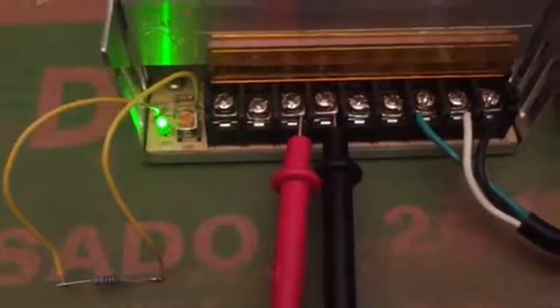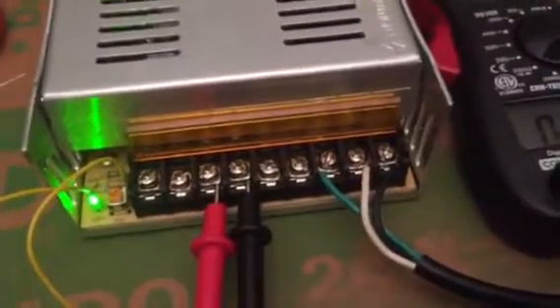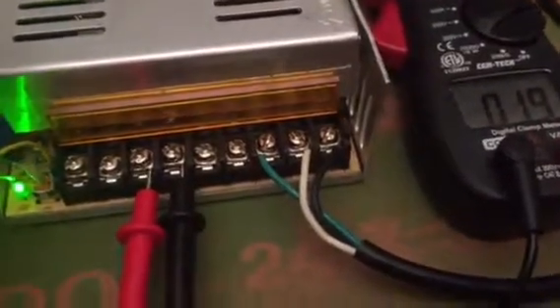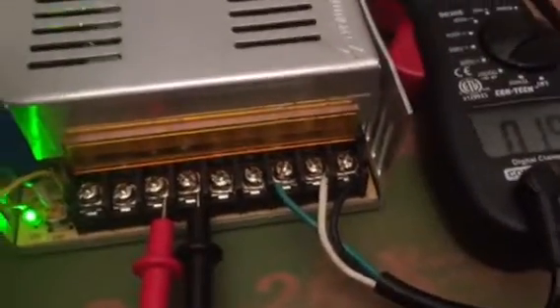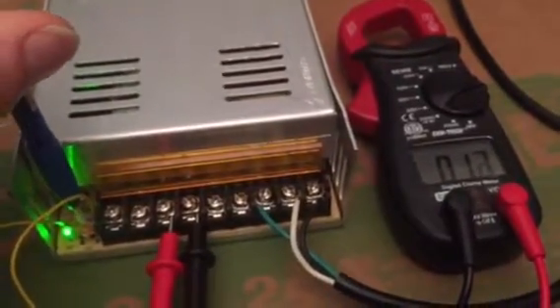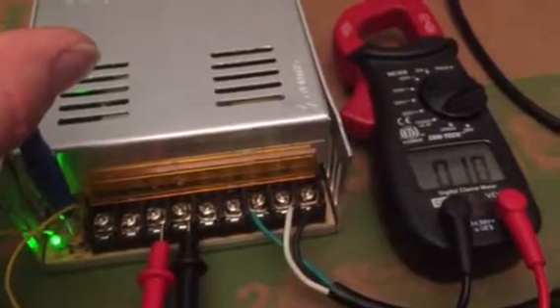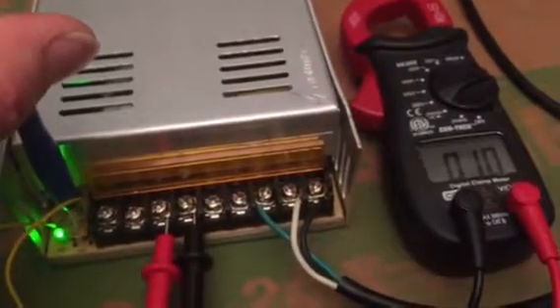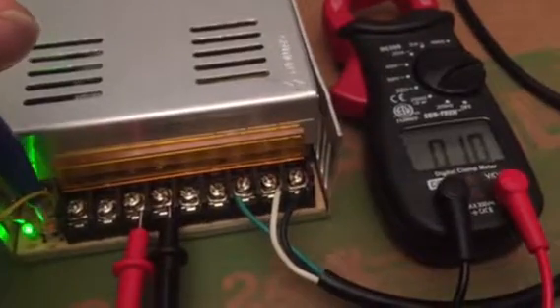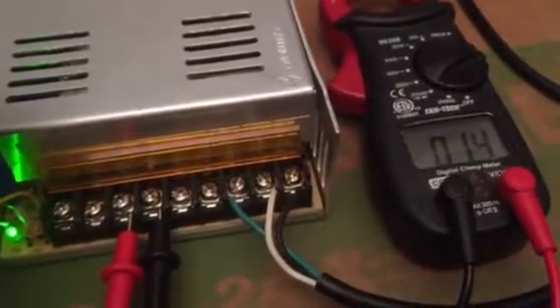So you can put a 1k ohm resistor or a 1k ohm pot in R40 — either way you get your increased voltage. The units have 25-volt caps in them, so normally they'll go up to 21-22 volts. Since the unit has 25-volt caps in it, you're good at 21-22 volts.